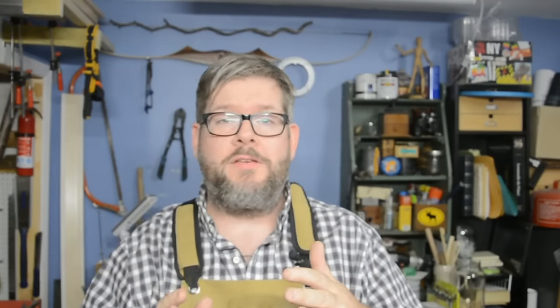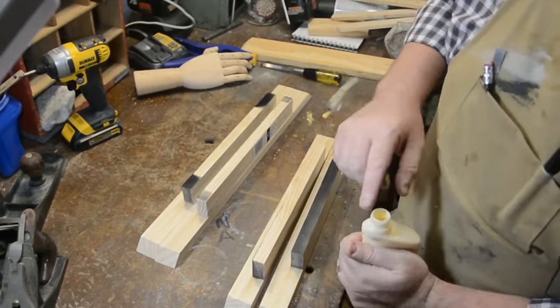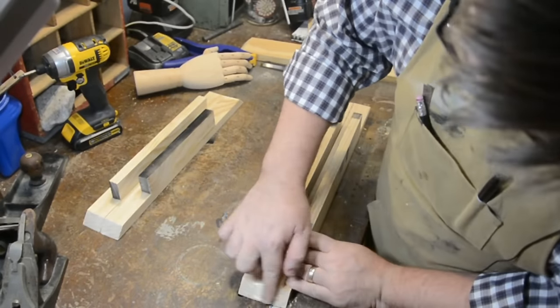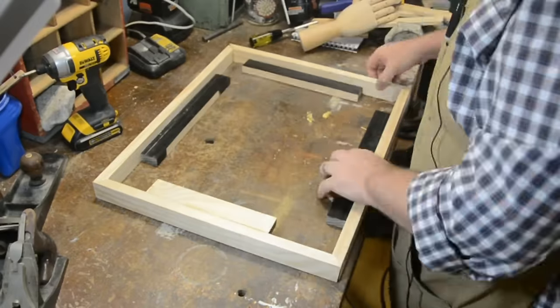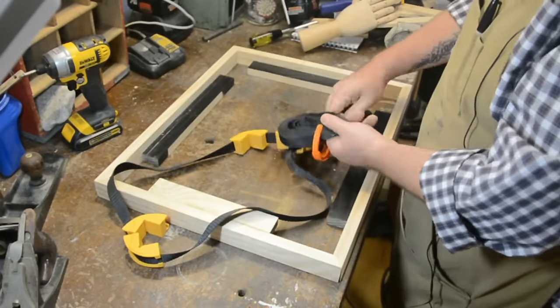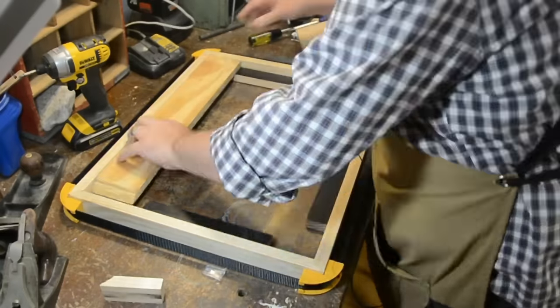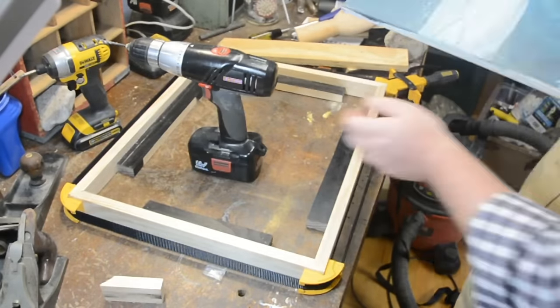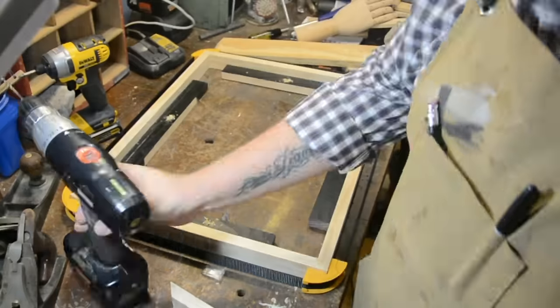The glue is all completely dry. That's the end of phase one of the glue-up. Now we need to take those apart and get them put together as the frame itself. We're only using wood glue for this — if you worry about that, go check any of the millions of people on YouTube who've already done the test. The glue and wood bond together stronger than the wood does to itself, so the wood fibers grown together in nature are actually less strong than the bond created by wood glue, which I think is crazy but absolutely true. And this isn't going to be something we're using all the time — it's going to hang on a wall, so wood glue is plenty strong. After checking to make sure everything is nice and square, I'm going to lay the canvas inside, check the spacing, and then drill out the four holes for the mounting screws that will attach our frame to our canvas.